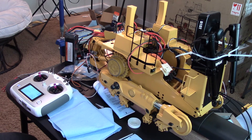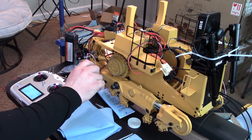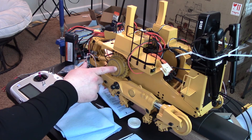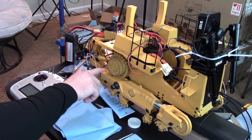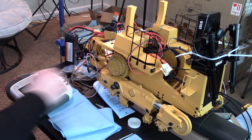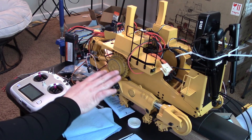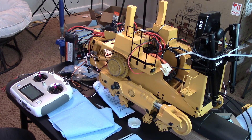Hello YouTube, this is Kevin again. After getting this thing lubricated, I can show you how it operates. Essentially it was me filling it until bubbles were coming up, then going back and forth a little bit, then filling it again. It just kept going until every time, once I had this level flat over here or over here, I'd go back and forth between the two until all that was coming out was oil. Another way to do it is, once you've got everything wiped off, put it at that line and then drop it a little bit — if it comes out then, you know you're about full.